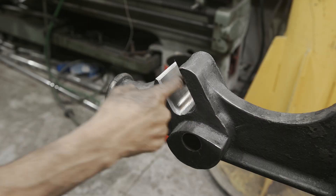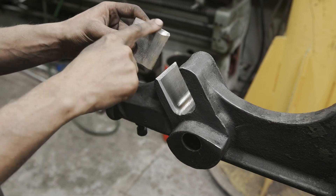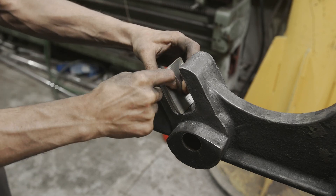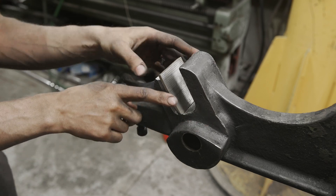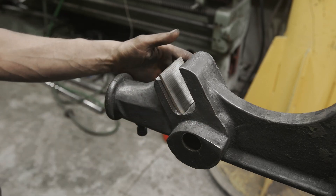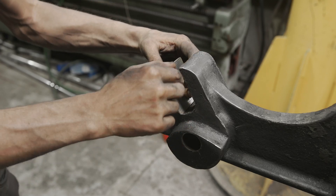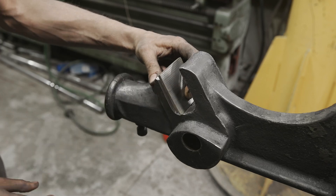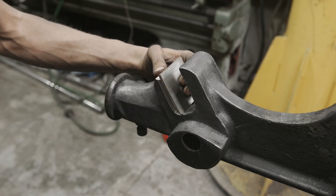We got this out of the mill and got it all cleaned up. I went ahead and wire brushed this area, removed all the paint, and then beveled this out nice and heavy. Our bottom piece here is beveled nice and heavy, and we have the round to match the radius. It's a nice flat fit because we milled both sides, and I have a little bit of extra overhang on both sides. When we're done we'll clean up these faces — there'll be extra material on the three sides. Now I'm going to use a bolt spreader to hold this in place while we braze it so it won't fall out. Then we'll fill these Vs and the front with braze, and that should be perfectly fine.